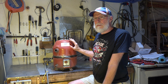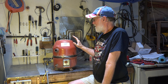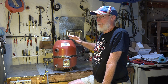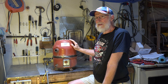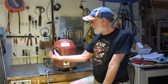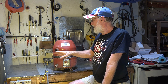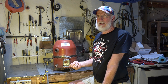One thing about this compressor is: how do you cool it? It has a motor, and this one is three horsepower. An open compressor often just had a fan to blow air across it to cool it, but these hermetics don't have that. These are almost entirely cooled by the returning suction gas. This is the suction line here.